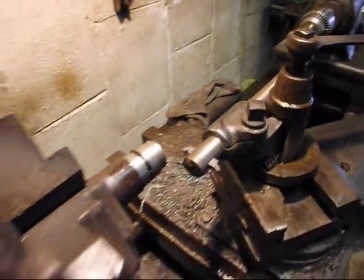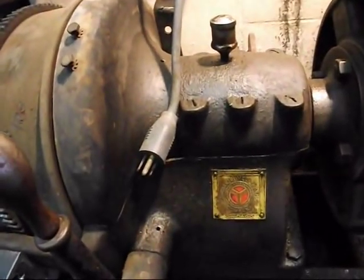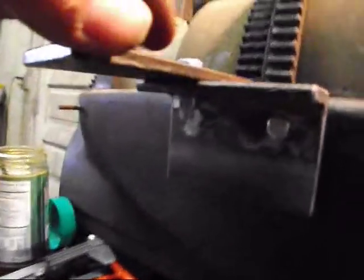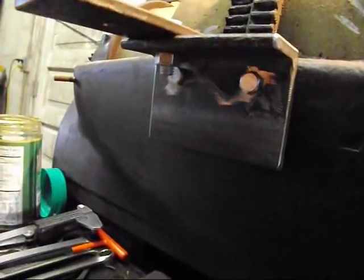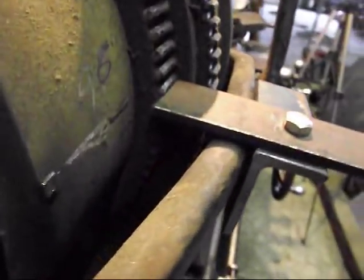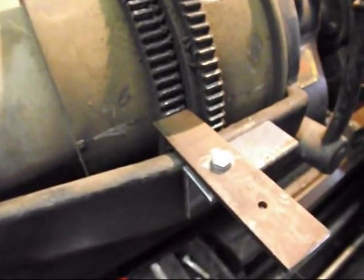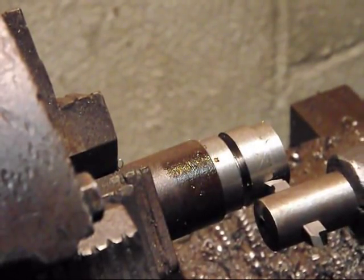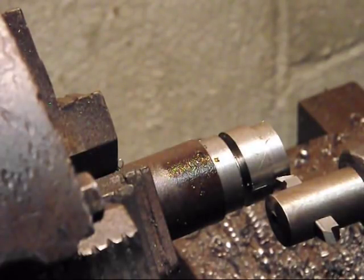So let's see if I can make this work. Got the lathe unplugged. Just made this little deal — there were actually a couple holes here already in this housing, so I just bolted this angle iron, this piece of strap iron on there, and ground the strap iron so it fits into the teeth. Let's give it a whirl and see if this cutter works — see if I'm anywhere close to something that will produce a gear here. That's a good line and that is at 12 on the dial.